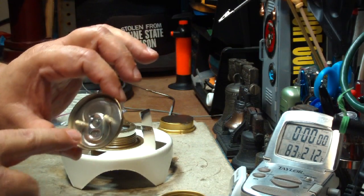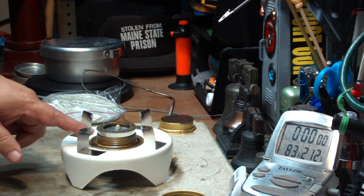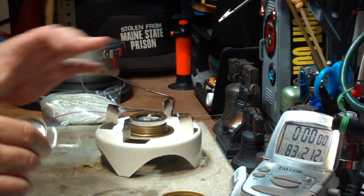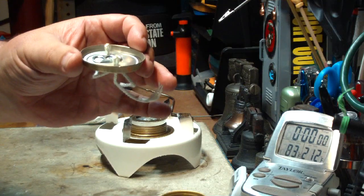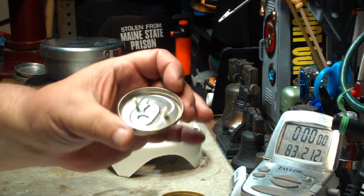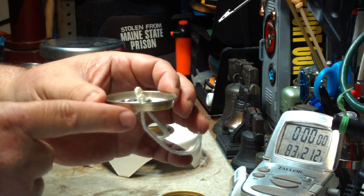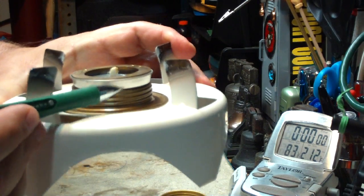This was the first one I tried with two wicks. It fits right over the Trangia real nice — it covers the jet. On the first test, I got a 135-degree rise in water temperature in 11 minutes, so according to John's chart from over at Flat Cat Gear, that was the equivalent of about 220 watts. The only problem was, with thermal feedback, the jets were sending alcohol out from underneath, so it might not have been a good test.